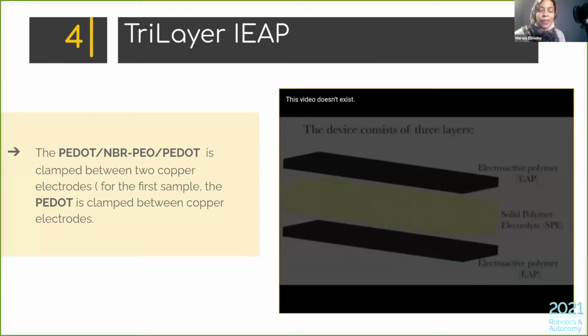Then you take it and apply the voltage. When the voltage is applied, the electrons move in the conductive layer, the black one. Here the operation is happening. The positive and negative have an electrostatic interaction. Imagine the cation is much bigger in size and radius. It means it can't move. This material has a polymer network chain, so you can imagine it like a chain, with the positive and negative, and electrons moving on both sides. If the cation is much bigger, it can't move; if a force attracts it, it doesn't move because it's so big. However, if the anion on the other side is much smaller, and there is attraction or repulsion, it can move freely. That makes it bend in either this direction or that direction.